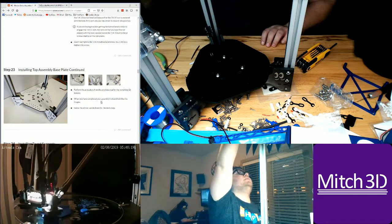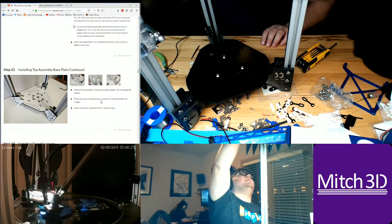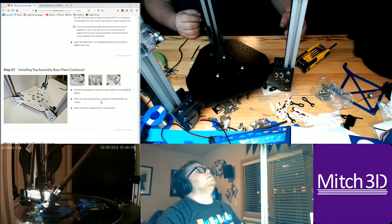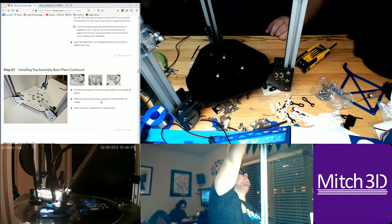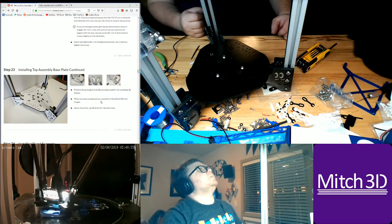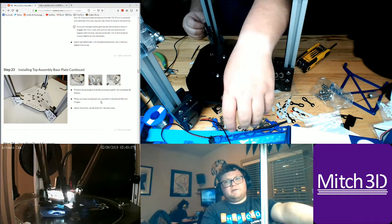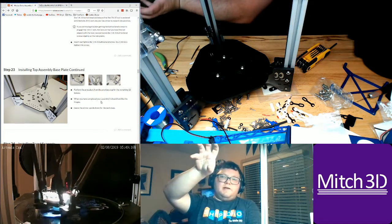But the Aris had the same thing. The thing on the Aris is these little base plates up here at the top where the feet are. I can remove those feet and just create standoffs and directly screw those in, they're only nylon. So if I could just basically screw those into a base plate that has slots for the bottom brace here, either way, I could rigidly mount the feet to the base plate, and then the top would just hold on to a spacer here that jets out to the top of the frame, and then all this is open space. The main thing is the top and bottom have to be rigidly mounted, and they have to be spaced out.